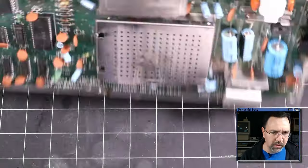So the Commodore 64 is fully backwards compatible with the Max machine, and the dead test cartridge takes advantage of that fact. It boots the Commodore 64 into the Ultimax mode by asserting the GAME and EXROM lines correctly on the expansion port. And so the Commodore boots up into a very minimal configuration, which allows you to test things without having those other chips in the way to interfere with what's running off of the cartridge. Anyway, I thought that would be interesting to those of you who haven't heard it before. I did mention this on the live stream, but for those of you who weren't there for the live stream, now you know. Okay, moving on.